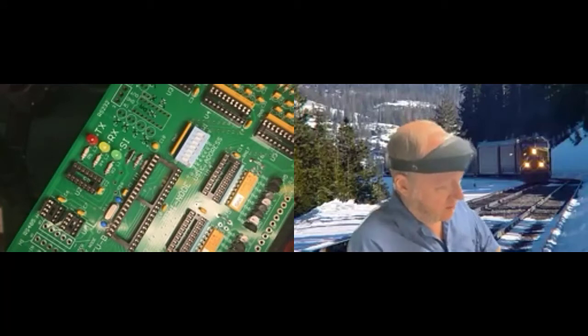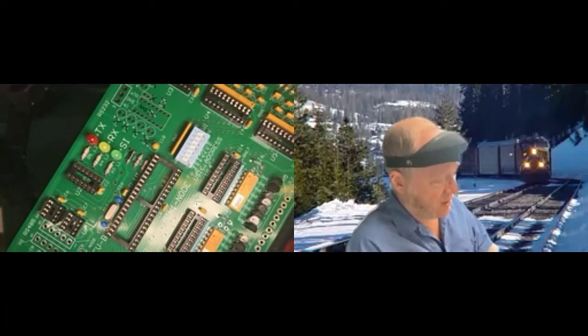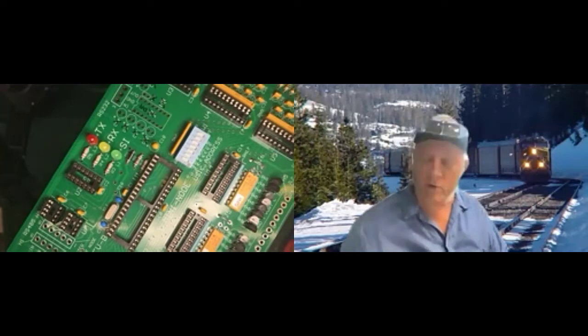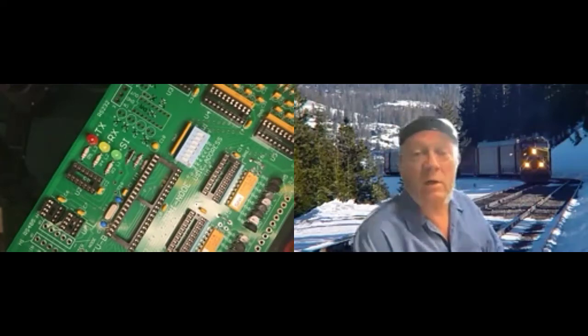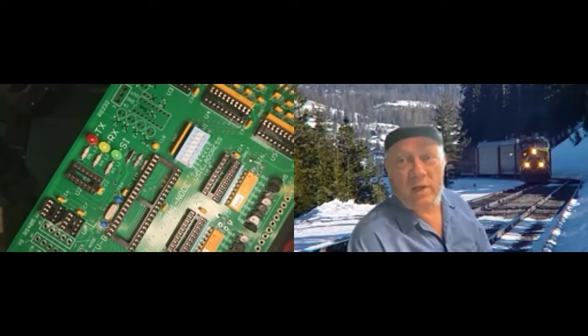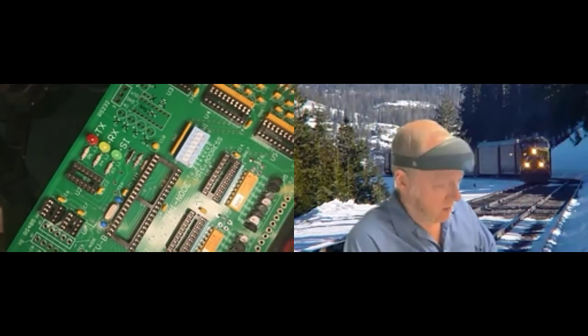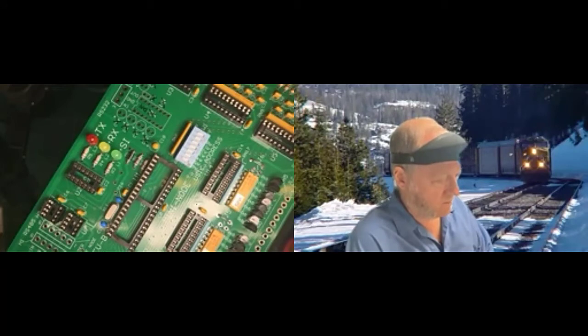The professional braids actually have a tiny amount of flux put on them, and that makes it a little easier. But yes, stranded copper wire would work, particularly if it's braided loosely, so there are voids for the solder to flow into. My newest soldering iron actually came with a sort of plunger type solder remover.